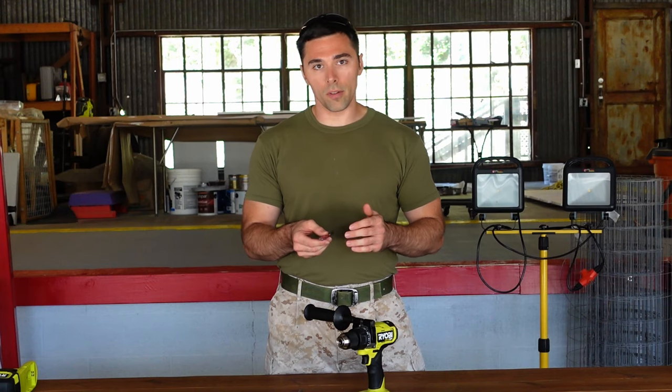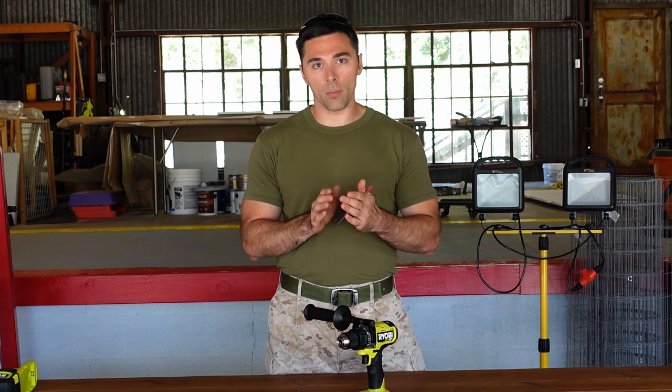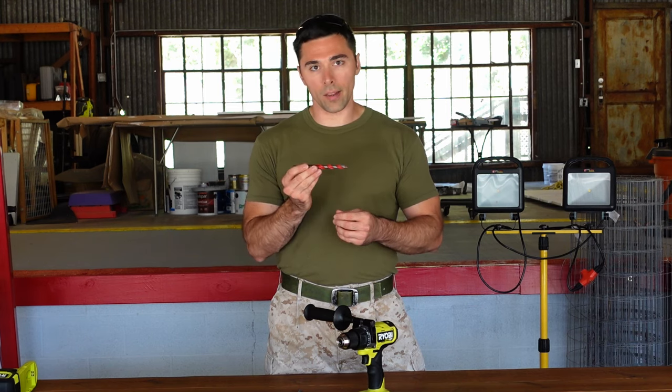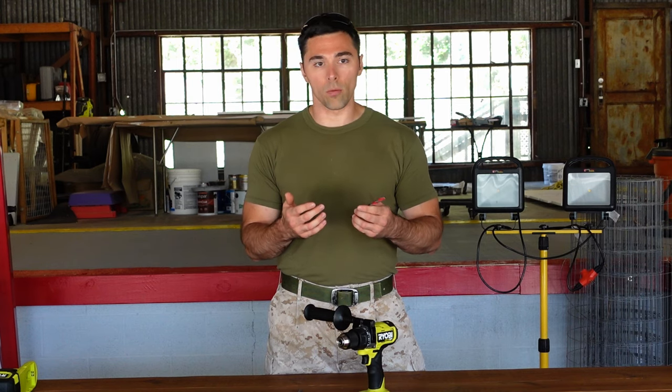While it's still doing its normal rotation, the hammer drill uses two metal discs inside to create a hammering effect on the end of that drill bit, allowing it to actually tap away at that concrete, help break it up, and therefore allow you to drill through that hard masonry work.